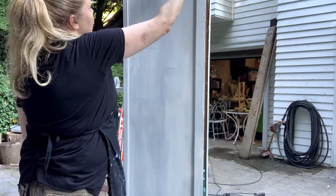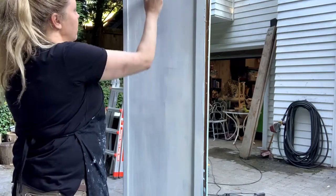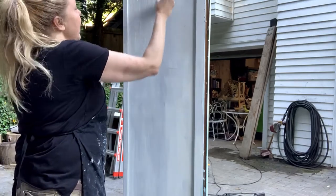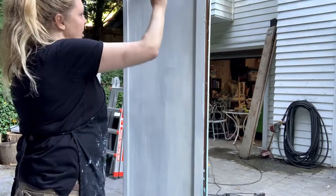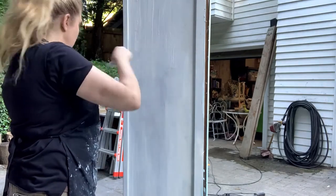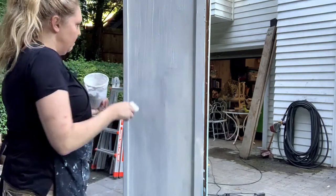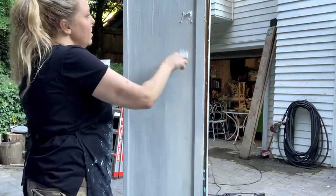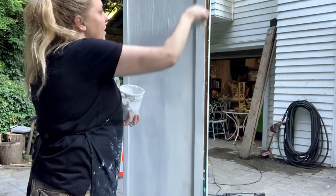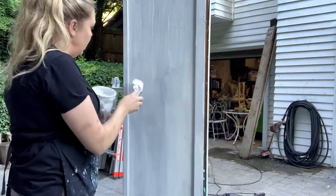Now after you're done applying it, you're going to want to use your metal scraper or your trowel. It's plaster, as Amy says, plaster loves metal. They're made for each other. And if you don't want to dry out your hands, if you're messy like me, you can always wear gloves. My hands are very dry today from doing this yesterday. And you don't want to have any lumps, not too thick, just a thin coat, and then you will add more after it sets up. You'll have more to work with. But this lays a foundation.